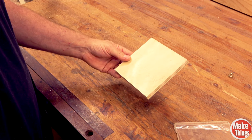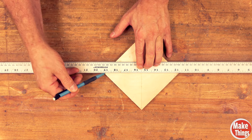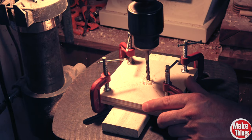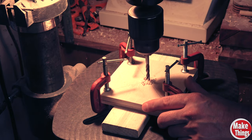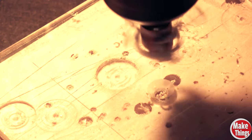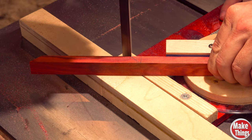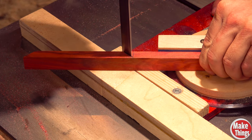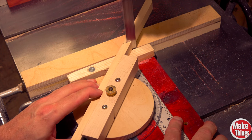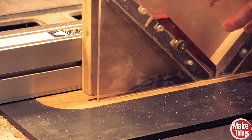For the base I used plywood, which is my best option for a flat box. I found the center before drilling it and a quarter inch piece of acrylic together. Because the acrylic will need a cone shape I added a countersink to it — it has to be below the surface or my router will bump into it. Next I cut 45-degree angles with my bandsaw sled on eight separate sides.